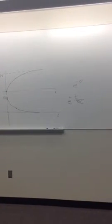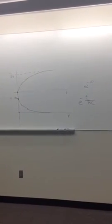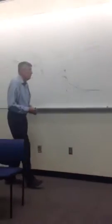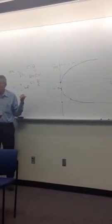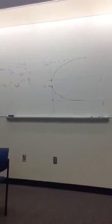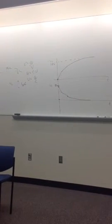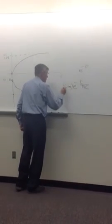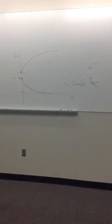Patrick. Would it be 10 million? E to the minus zero is what? E to the zero. One. It's going to be equal to one. So this would evaluate to 1 at t equal to 0, but what do we want it to evaluate to? You said it goes to 1, but what's my graph say? It should be, at t equal to 0, 10 milliamps. So we need a scale factor of 10 milliamps. So that expression at least hits the boundary condition for us. And it is actually the correct equation for this.